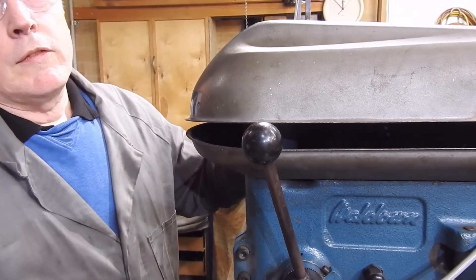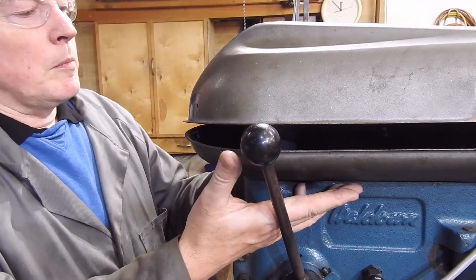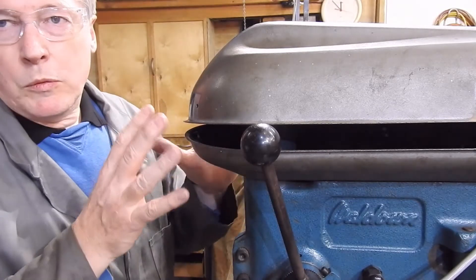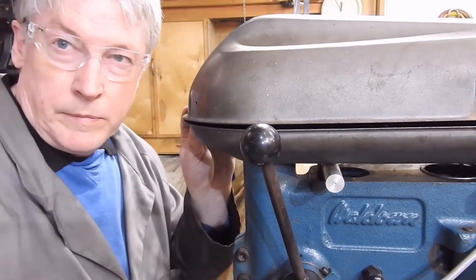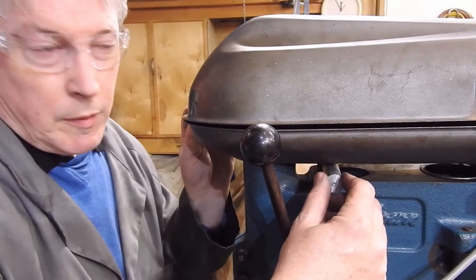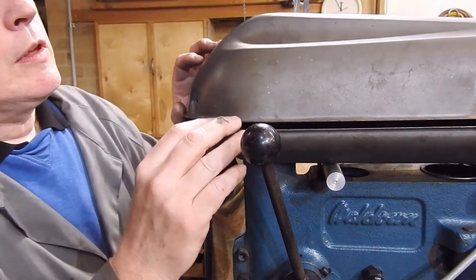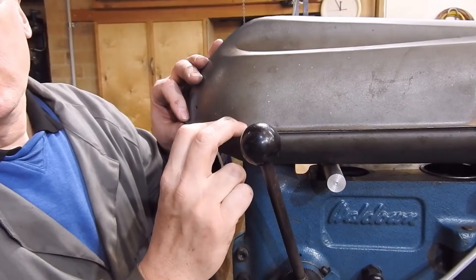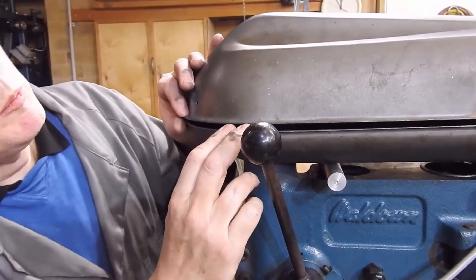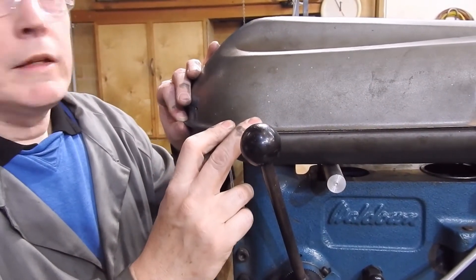To get round that I'm going to have to lift the hinge up 20mm, but what I'm going to try first is just blocking that up using some 20mm RHS or something like that, just to check that it will solve my problem. From the school of grab the nearest thing you can find, I've got a bit of 20mm diameter rail aluminum here and down this end I've got some 20mm RHS. The important thing is that this can close over there and not interfere with the pulley - it comes mighty close but it clears.